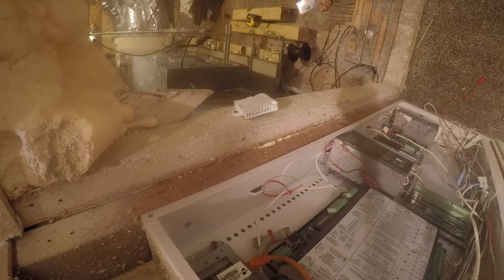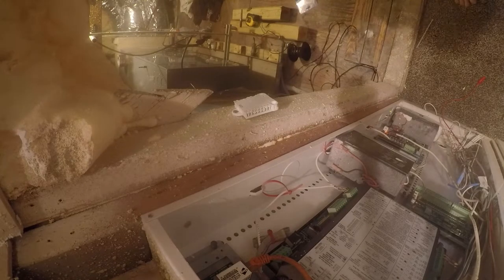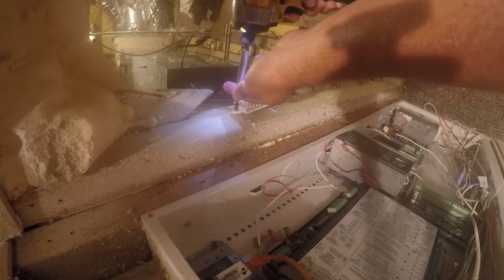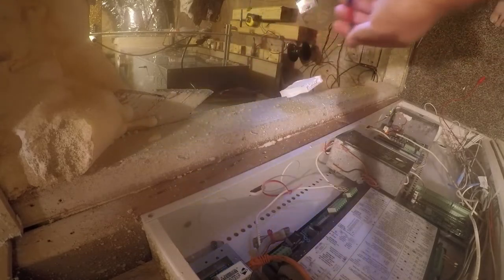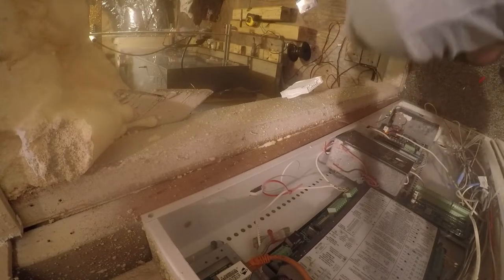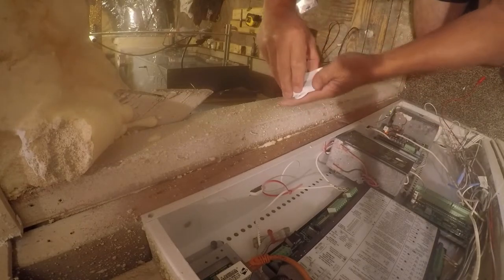So the reality is, it was never supposed to be here in the first place. It was here because the good-for-nothing unit fried the network side of the communicating board because Honeywell was too cheap, or Emerson, I don't remember who made that board. Anyway, they were too cheap to harden the board. So nearby lightning induced a current and it fried it.